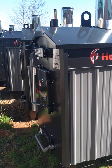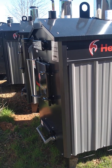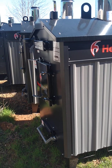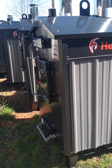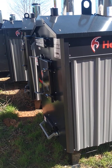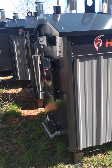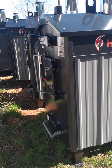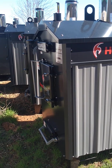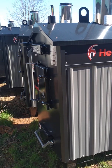Good morning folks. Today I'd like to talk about some troubleshooting tips if you find your furnace overheated or boiling. Some people have asked what indication they'd have that it's overheated. I would say anything over 10 degrees more than your set point — your shutoff temp — which we usually set at either 170 or 180 depending on the model. So if you see it at 190 or 200 degrees on the control, something's wrong; it shouldn't run that hot.